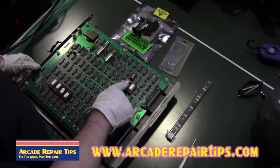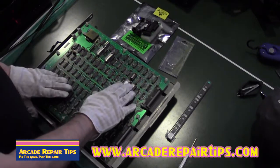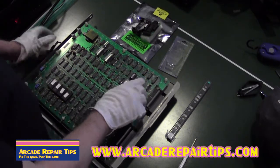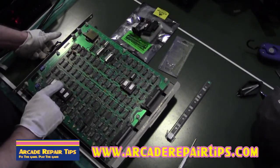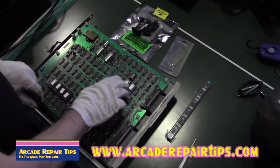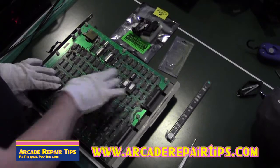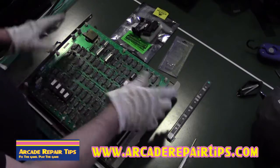Now that we've installed all of the chips, the first thing we're going to do is double-check our work. Make sure that the notches are all going in the direction they're supposed to — which was upward in our case — and they're all the same way. Also make sure I didn't get something mixed up, which is easy to do. We've got C, D, E, F, N, 3N, and 3P here. Joe did a good job of labeling those for us, which makes it easy to know everything is right. I'm also pushing in to make sure there are no bent legs. Everything looks really good on this end.